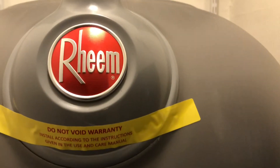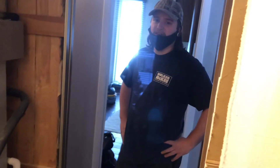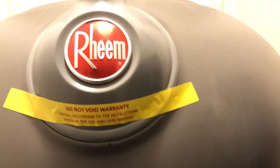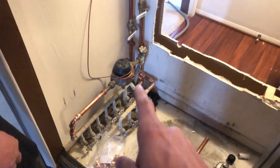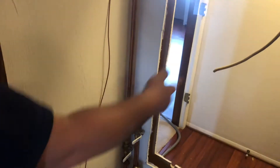Check out these tanks — the tank is warranted for life and the parts are warranted for 10 years. John was explaining that if an element goes bad it's fairly inexpensive, like 20 bucks for the part. Labor would be about an hour, so depending on the company probably around 100 bucks. For about 120 bucks total if the element goes bad 10 years from now — that's a lot cheaper than paying a couple grand for a new tank. He also put two isolation valves for supply and feed from the tank so you can service the tank and still have water to the rest of the house.